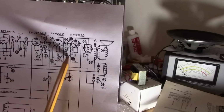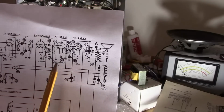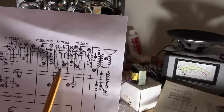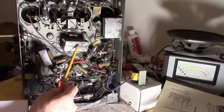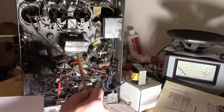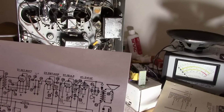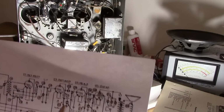This number 30, this number 30. Notice they both have the same part number. It's because there are multiple caps inside of one enclosure. And think about it. We have multiple caps in this box. If they're leaky, the audio signal could go from one to the other and find its way through there, is what I'm thinking is a possibility.